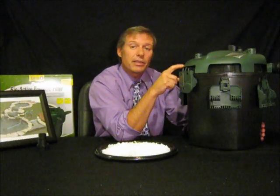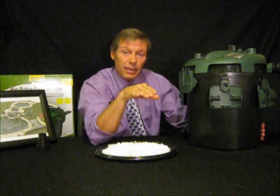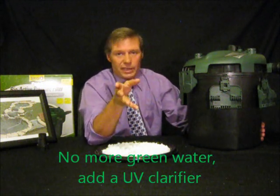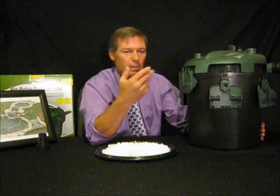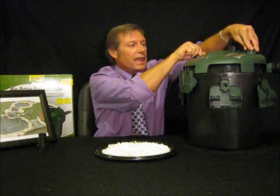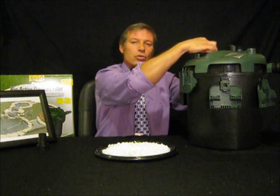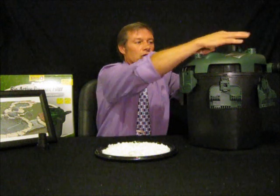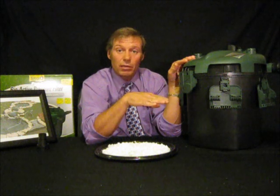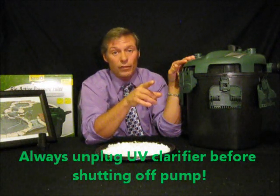There's another thing about this — they come with UV lights. Some come with and some come without. If it was me, I would do the UV light. Now, once a year you're going to have to change them out, and it's very easy. There are two little knobbies up on top. You take it, pop it over — it says 'open' on it — this little piece comes right off, a couple of screws inside, you drop your bulb down inside, and close it back. Make sure that if you ever shut this down for any reason, you shut the UV light off first, because if not, you're going to burn the UV light out.